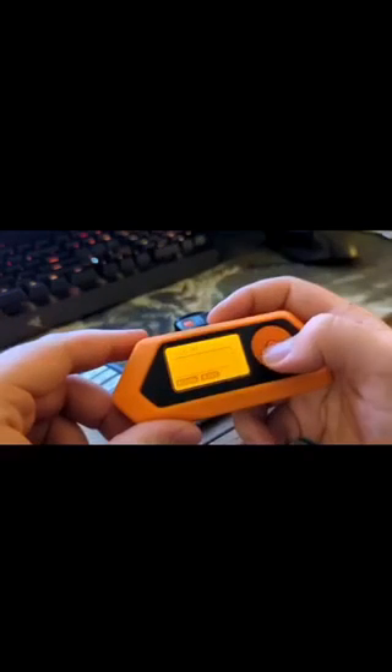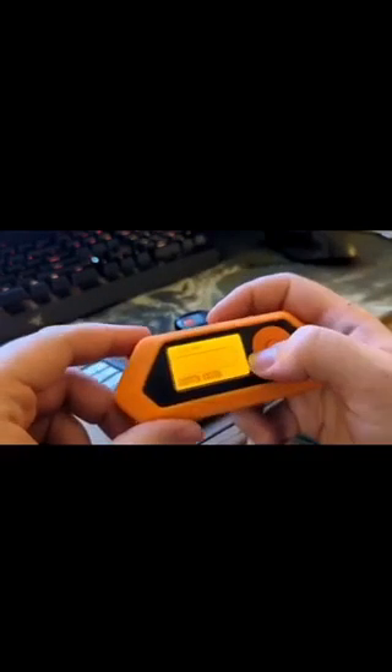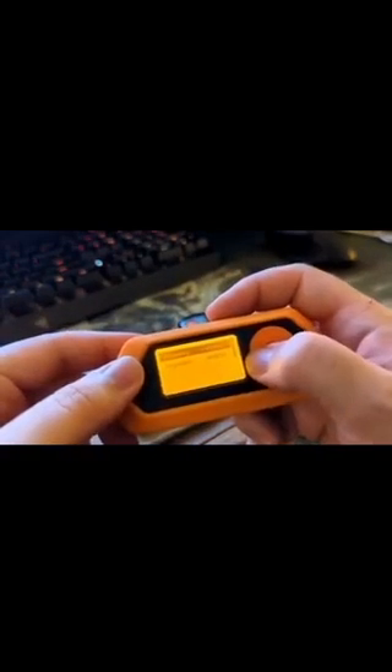Make sure you go down to read raw, but you want to change the configuration, because right now we're scanning at 433. So you want to change your frequency all the way down to the bottom where it says 315, and change the modulation on the bottom to AM270.